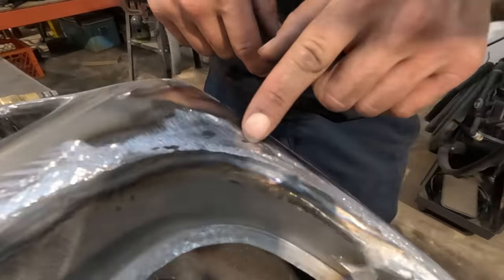If you think of a golf ball dimpled type surface, when you have a flatter hammer and a dolly that's closer to the actual surface, as you hit them there's gonna be a wider contact patch and it will be able to cover more surface area at once for smoothing, which is planishing. Planishing hammer and a dolly. So I'm feeling on the backside as to where the dolly is versus the hammer hits. It's nice to hear the dolly on the backside and to know exactly where the dolly is. That's how you know when you can't see the dolly.